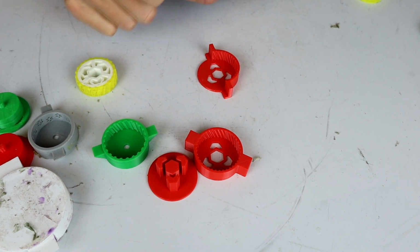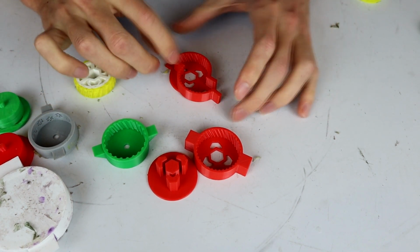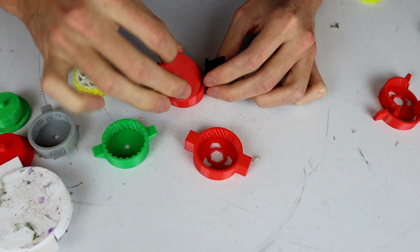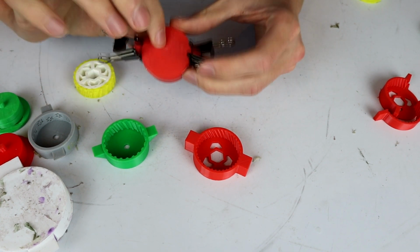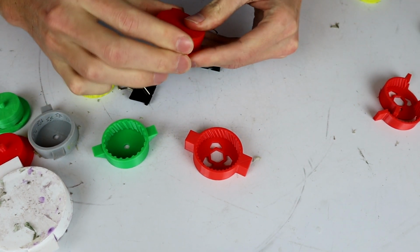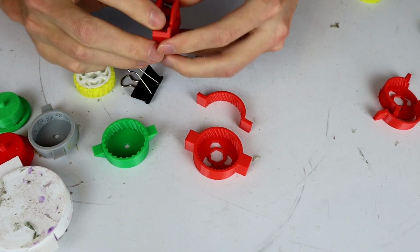It is a mold. It's now a 3-part mold though. So this is to help with getting everything back out again. Basically the idea is to use binder clips, binder clip this thing together like this, put the top of the mold in, compress that all together, hold everything in place, and then when it's time to release the wheel, unsnap, and we should even probably be able to just slice that out, which means that we're going to have a lot less force on the wheel.